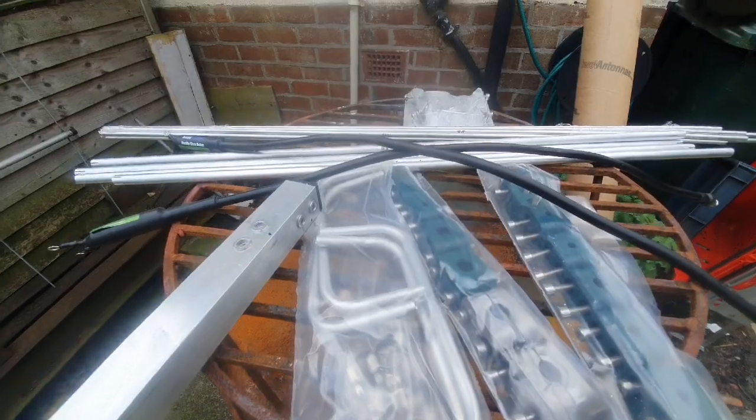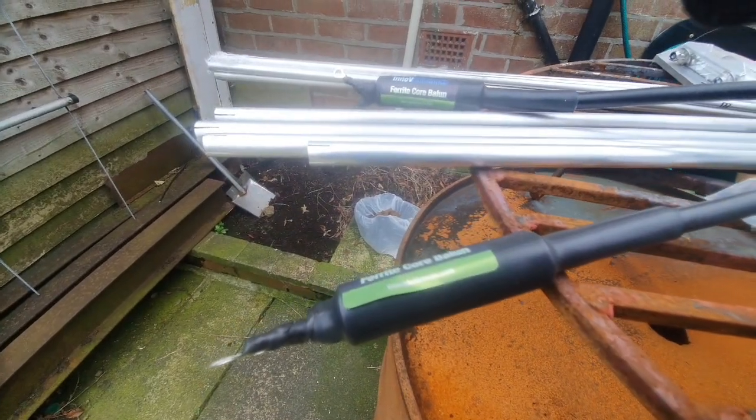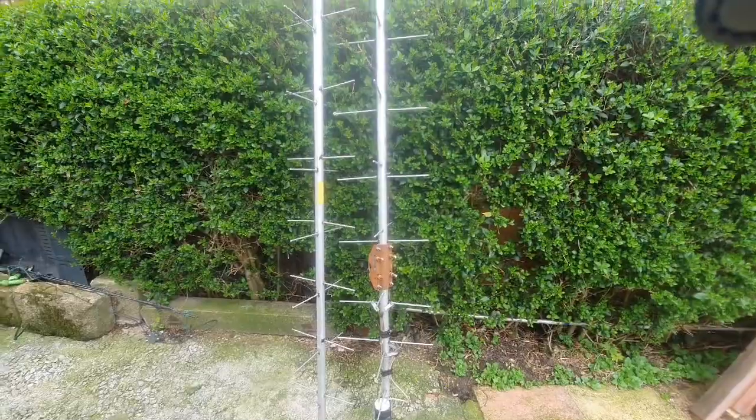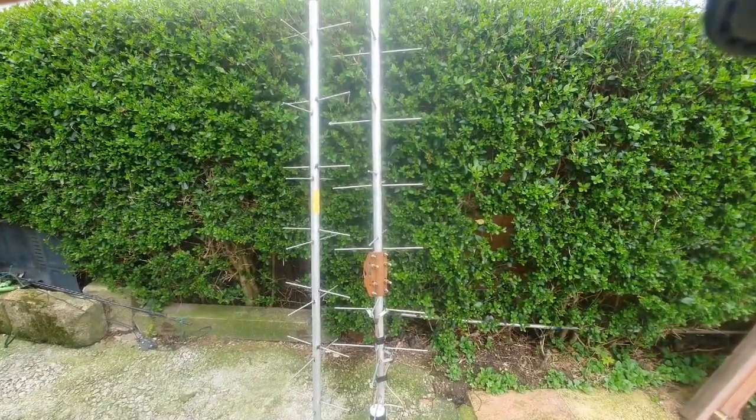It comes with a couple of baluns as well, which will make the antenna perform pretty good. It's a 12 element total X-pole for 145 MHz. On the other side we've got another X-pole — originally just half of an X-pole — and I'm thinking about putting both pieces together. I've got both halves there now, so possibly connecting both pieces up to have extra elements in line. Less talking for now — best get busy building!